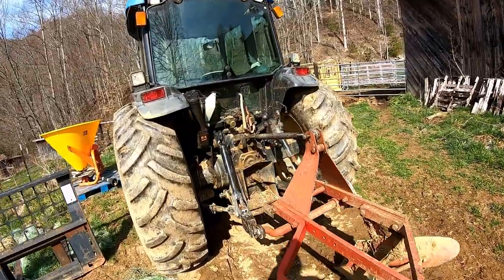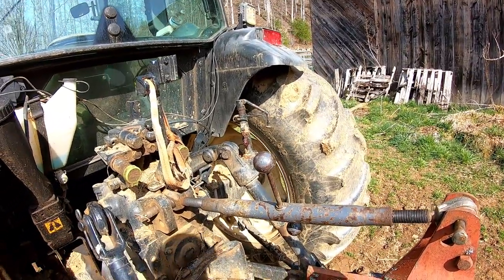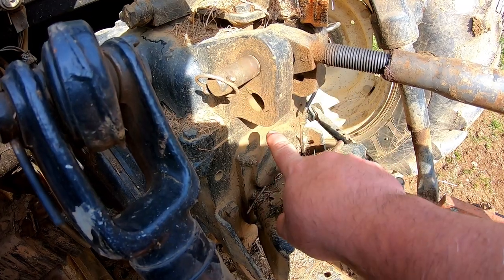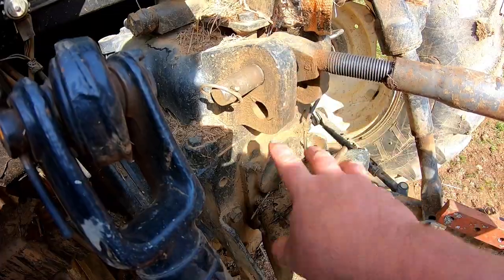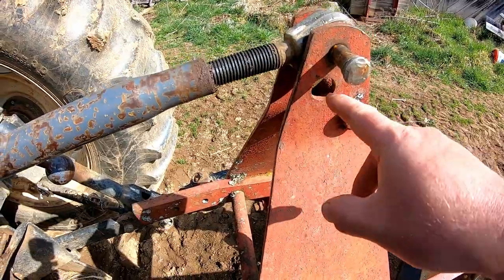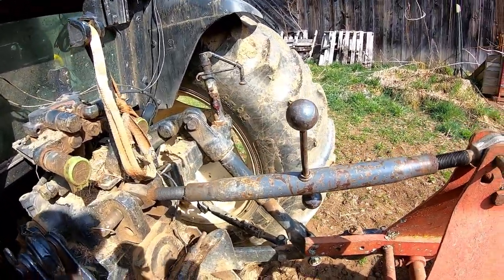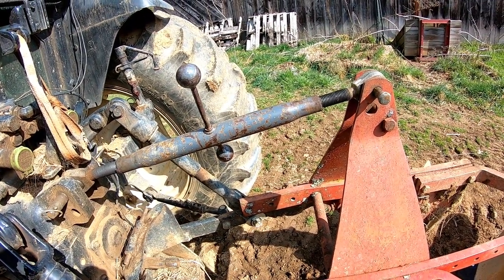What you've got here is a sensor — if it gets pulling hard, it applies pressure and the lifts come up; if it's pulling too easy, the lifts go down to maintain that depth. A couple things about draft: remember three-point hitch and plowing is all about geometry. You can set it more or less sensitive, and you can also move your top link down a hole — some have three holes — which makes it more sensitive. Changing this geometry will affect the draft control, so play with it and find what works for your application.